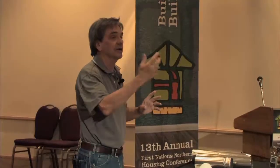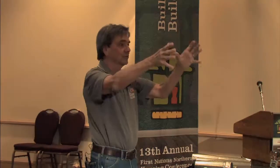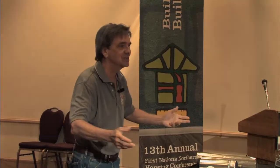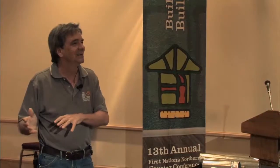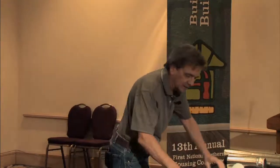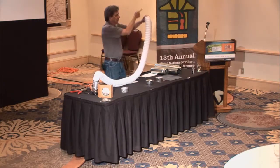We went in and we soundproofed his bedroom. We gave him an exterior door on the inside with full weather stripping, guillotine on the bottom, the whole thing. This room, nothing came through. Now, of course, he couldn't breathe in there. So we gave him a small air-to-air heat exchanger just for one room. It went straight outdoors, so we got fresh air in, stale air out, right through the wall. That didn't have anything to do with the rest of the system. And we put baseboard electric heaters, even though it was a gas-heated house. His room had baseboard electric heaters, so there were no ducts, and he had no duct connection to the house. Once that was all installed, it really surprised him when he got up, walked out, and there was a party going on and he didn't know it. So he had total isolation, but we had to give him heat and ventilation of his own.